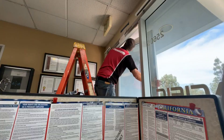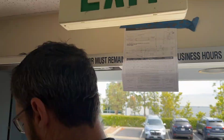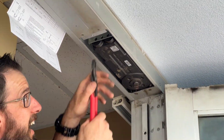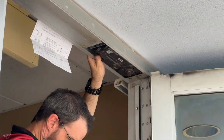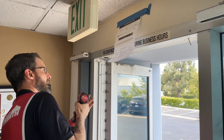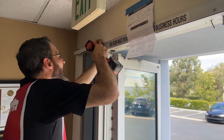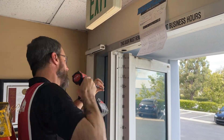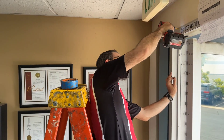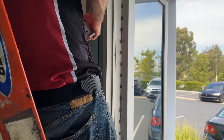We're going to get started by mounting our external door closer instructions up on the door frame, then take all the proper measurements. We're also going to pull the concealed mounted closer out of the door — that's very important because it's a very heavy chunk of metal sitting above everybody's head. We're going to need to use the mounting screws for the external door closer that go right where that internal door closer was mounted. Once the internal door closer is removed, we'll prep this door for the external closer. We pre-drill and pre-thread those holes — I like to run the screws in before we actually mount the closer, just a little tip.